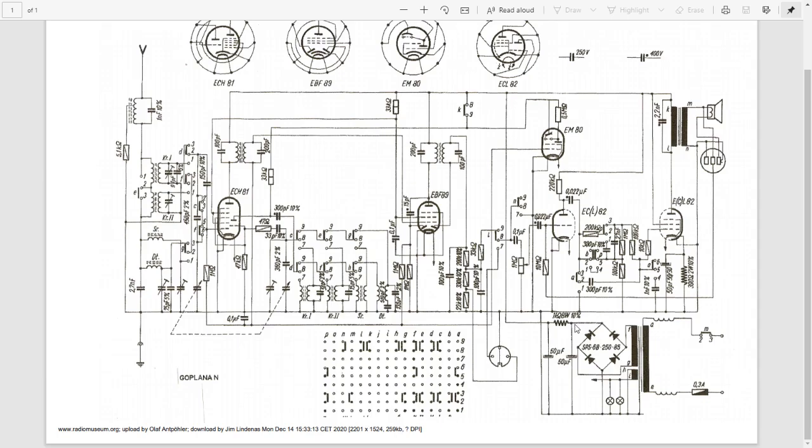So now, is there another big filter capacitor in here? Now, see how they drew these ones? Would they draw another electrolytic? I think this represents the can. I think that's what they're trying to draw here. Here's one. So here's another one. Okay, so this is the bypass of the 390 ohm cathode resistor for the output tube. And it's a 50/30. Not quite sure what they mean by this. Could be 50 volts DC, 30 volts AC. That's what it's capable of.